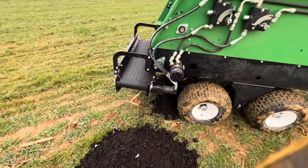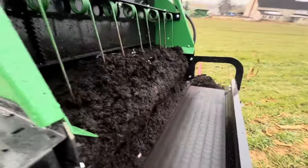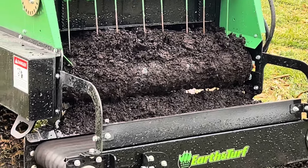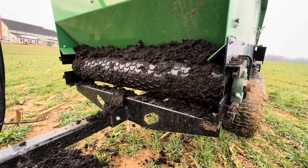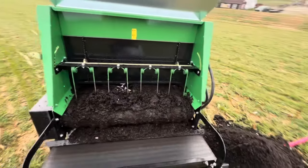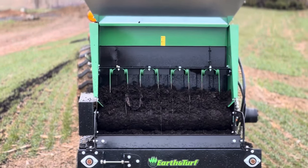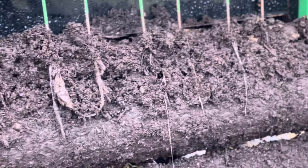Now this material is extremely wet — we're talking muddy wet. So you see it's making a little bit of a mess, bringing the material down through. It's caked to the belt, so you're literally fighting the belt itself because it's caking and then swinging around, making a mess in the front here from underneath. That's just what happens when you run wet material — it's not going to break the unit, but something you want to watch out for. These tines are grabbing material that is foreign or shouldn't be in the spread — some twiny material, maybe plastics depending on what kind of mushroom soil you're working with. They've done a good job holding that back and letting only the fine and siftable stuff come down, which gives you the best spread.